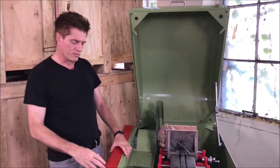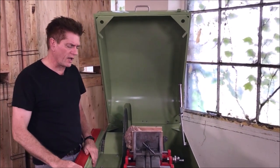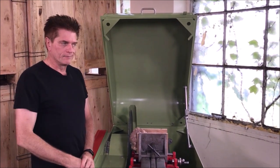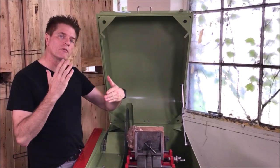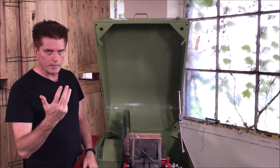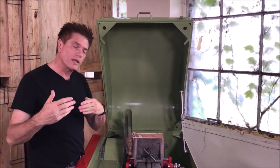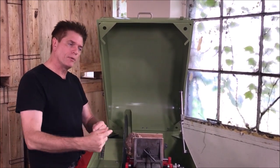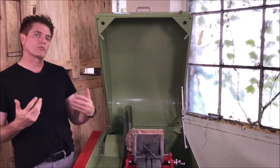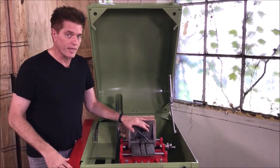One of the classic things I heard, which I thought was fairly funny but revealing, is I had a customer at the last Tucson show. He says, I talked to the guys at one of the other saw manufacturers, and they said the way you can get a perfect cut is to cut at the slowest speed possible. Now, they're probably right, because if the tank is really flexible, then you have to really baby that rock through so you're not getting distortion problems. However, that also means you're taking 3 times as long to cut the rock, and we're not all going to live forever, right? You only have so much time. And if you're cutting for money, you're getting a third of the production output and tripling the energy cost to run that saw. If you live in Arizona or California, where electricity is extremely expensive, that actually matters, especially if you're cutting for money. So our philosophy is cut as fast as you can.